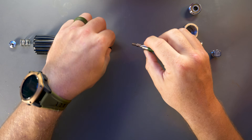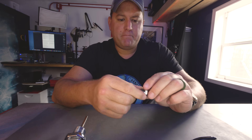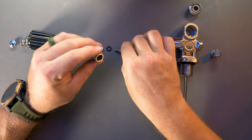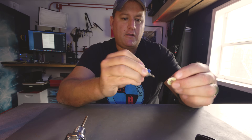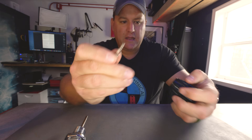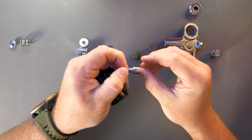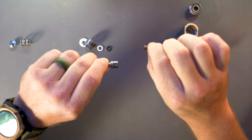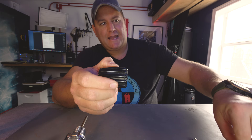The stem itself needs to be sealed. There's a small O-ring that assembles onto the stem, a neoprene washer which creates the correct amount of space, and then this piece here is called the bonnet nut. The bonnet nut's job is to hold the stem and high pressure plug assembly together while securing it to the valve handle itself. The stem passes through once you've got the O-ring and spacer correct, and then you have another neoprene washer on the other side to prevent friction. The actual shape of the stem is squared off — a square peg that goes in that square hole. When you turn your valve handle, it bites onto the square part of the stem, rotating through the bonnet nut and turning the plug to either seal or open the valve. That is all held in place and tensioned by this spring and outer nut here.